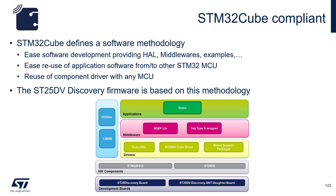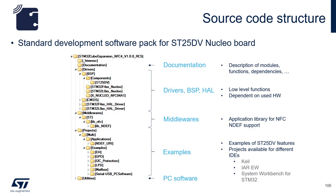If you use STM32 for your microcontroller, the existing STM32 driver is CUBE compliant. Also, the ST25DV Discovery firmware is derived from the STM32 CUBE. Here is a snapshot of the NFC04 software pack showing all the components. Notice that the examples are for F4 and L0 families as shown.